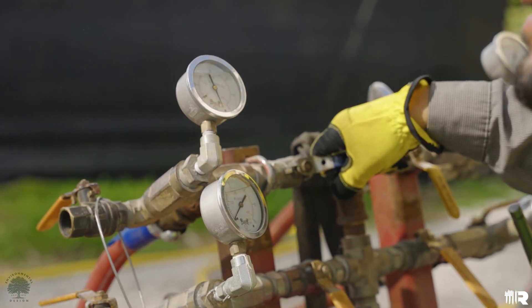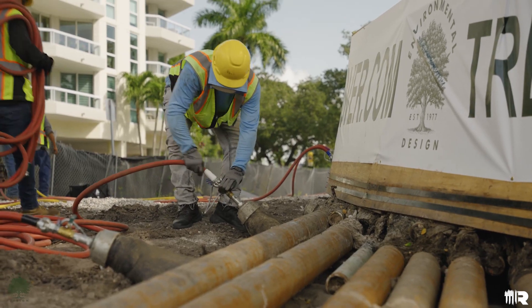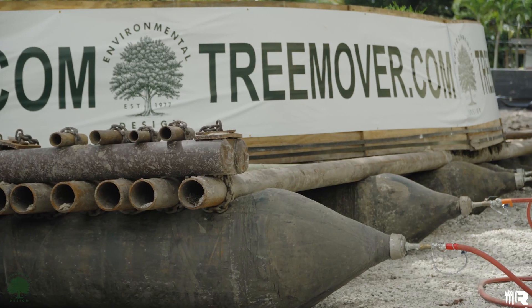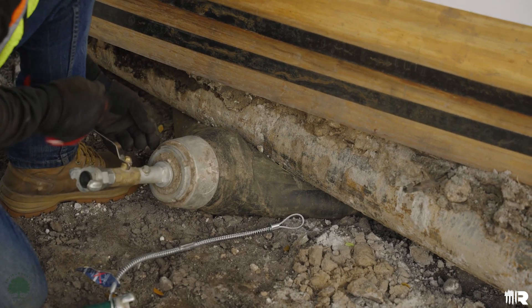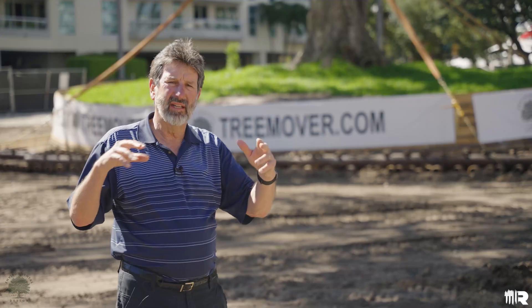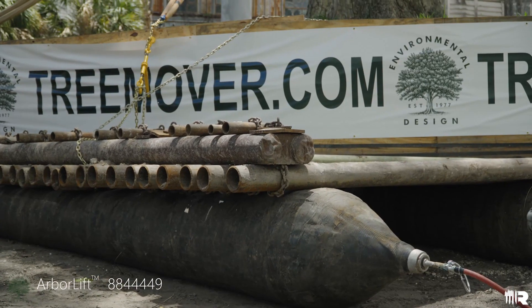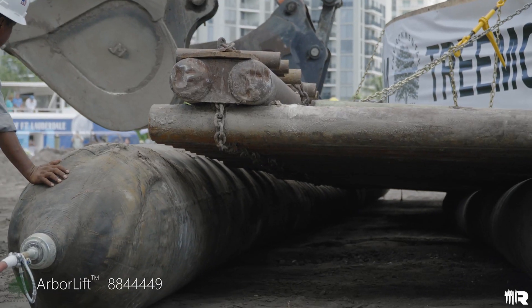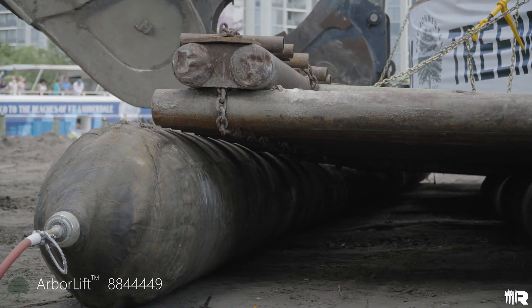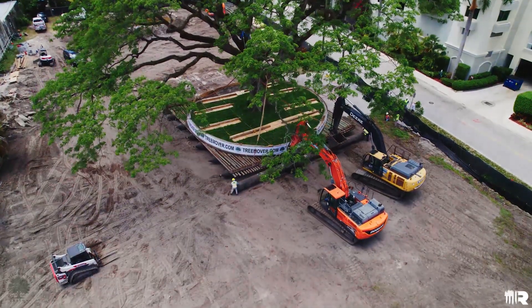We're lifting the hamburger up, and we have done the engineering to make sure that our grill is sufficient to counteract the 1,500,000 pounds. Below that we have our lifting bags — that's our ArborLift system. Each of the lifting bags has the capability of lifting about 250,000 pounds. We'll take this 1,500,000 pounds and roll it with these excavators as the prime movers, pulling and pushing it.